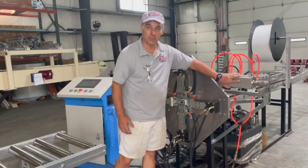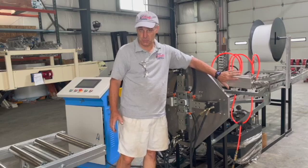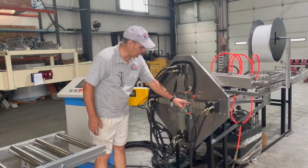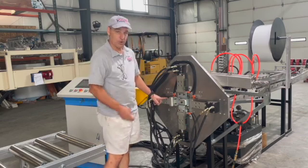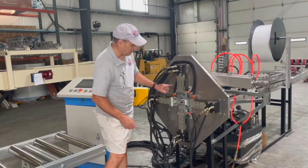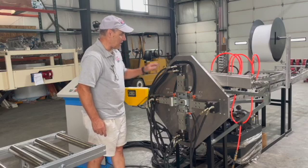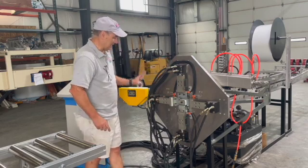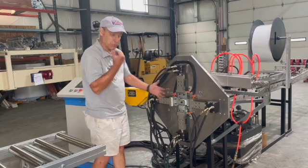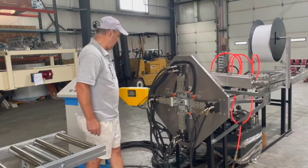You can see here the cylinder for the shear. Now this can be pneumatic or it can be hydraulic — this one is pneumatic. The four different areas for crimping for this setup for an A-elbow. We can adjust the depth for the top and the two sides with these adjustment screws, and it has a hydraulic push for each side of the blades for the elbows. When we switch to a B-elbow, we will replace these and change for the B-elbow.